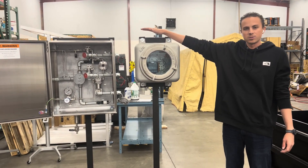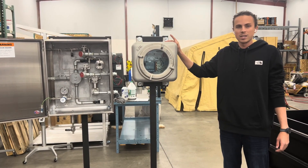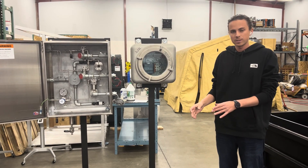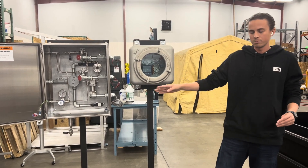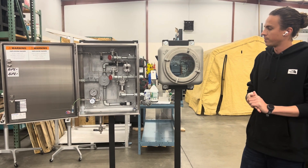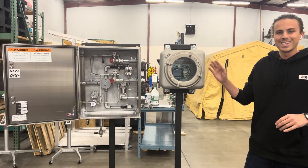The GPL 5000 is a differential pressure style odorizer, meaning it uses differential pressure or a higher pressure on a bulk tank to move odorant to an injection point. There's no pump involved. It's very simple, with a limited amount of moving devices in the unit.